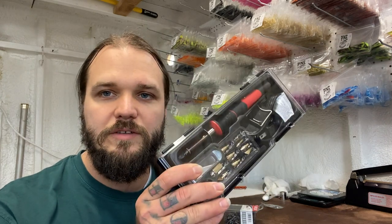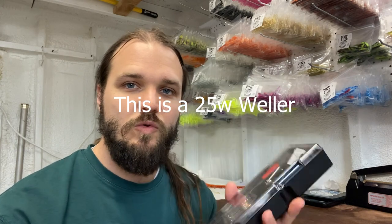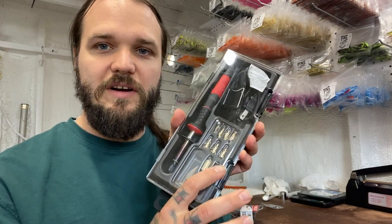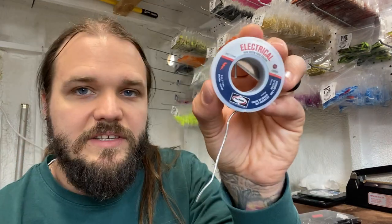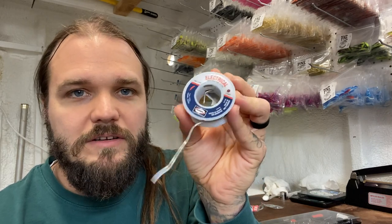I always go up to Home Depot — you're gonna pay for convenience. I will put a list in the description box below where I can source some materials for you guys on Amazon. You're gonna need a soldering iron; I got the cheapest one they had for about 20-25 bucks. You just need a fine point attachment. The best solder for this application is 60/40 rosin core solder — this roll was about twenty-five dollars, so it is one of the more expensive items on your list.